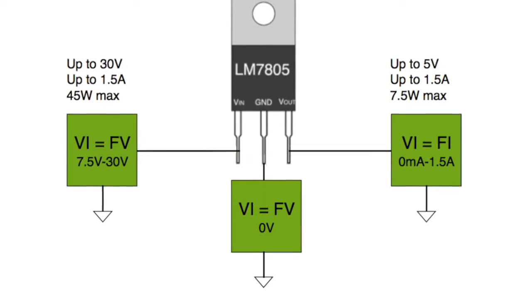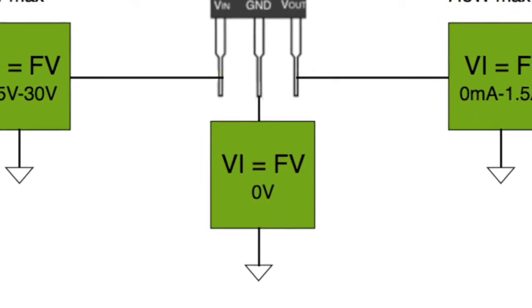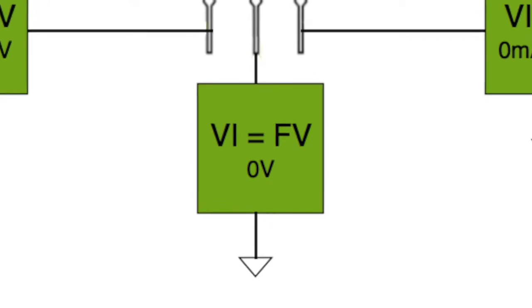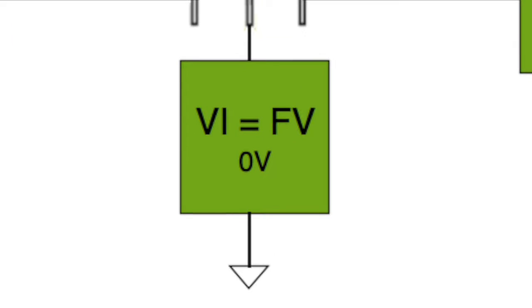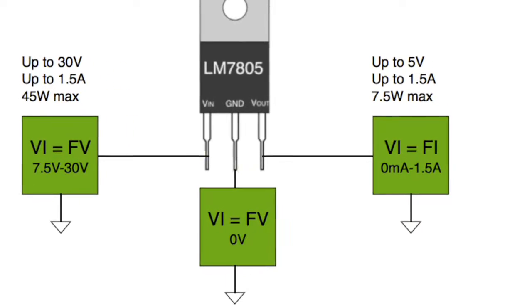The input VI must be at least 45 watts minimum. For the ground pin, I'm going to force it to zero volts — it doesn't take much current, like 5 milliamps maximum, and there is a spec for that. So measuring current on the ground pin — no more than 5 milliamps — may be one of your tests.